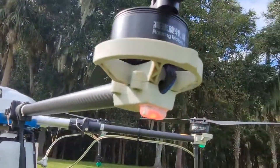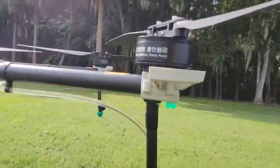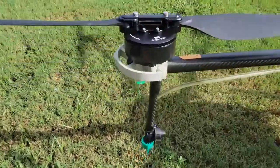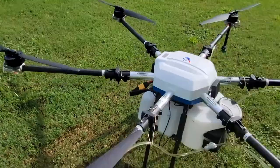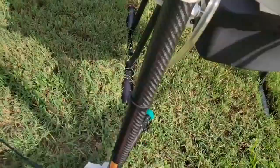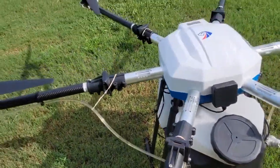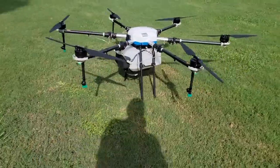There's also a camera hidden here — I didn't show you that first. These are lights; the aircraft is already equipped for nighttime operation. It's got nav lights — red on the front, green on the back rotors. Very easy to maintain and clean. It has extremely good drift control with the nozzle layout it has. Very simple to operate, easy to maintain, and it's field serviceable. Replacing a motor arm literally takes seconds — you unscrew one bolt, disconnect two connections, and you can release the entire arm.